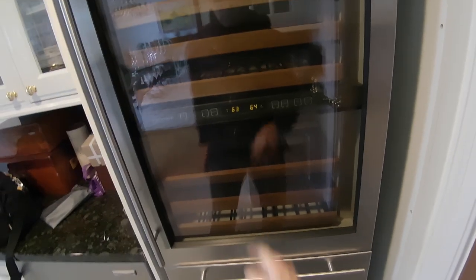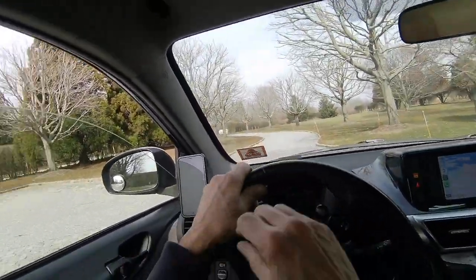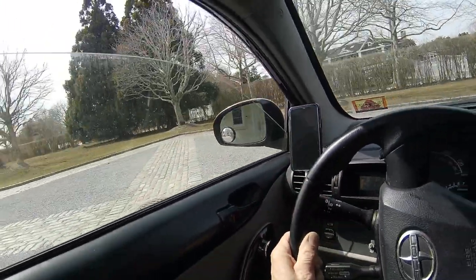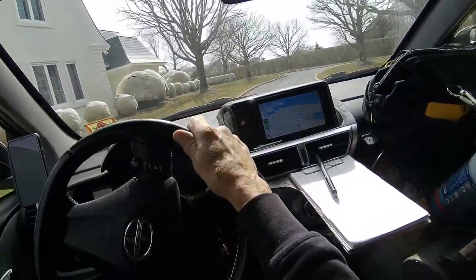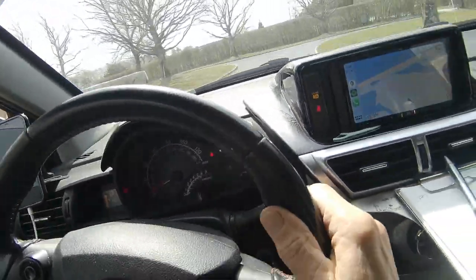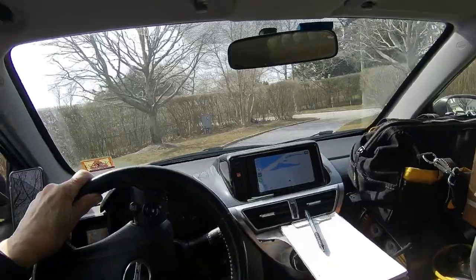Temperature's dropping down — that's great. Good to go. We're all finished up with this job. Just want to dish out a couple of reminders here. Be very careful when you pull out those units on the condensers because you can break the lines. Obviously that's what happened there — there was a little kink in that discharge line that went into the filter dryer.